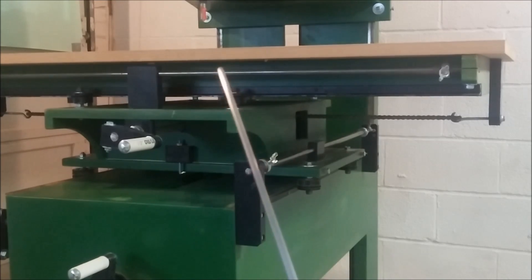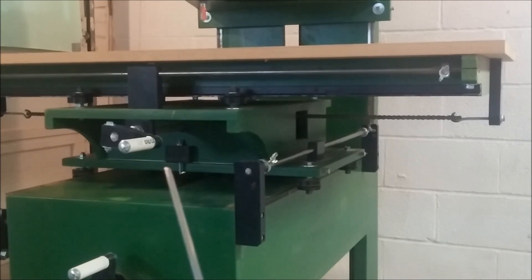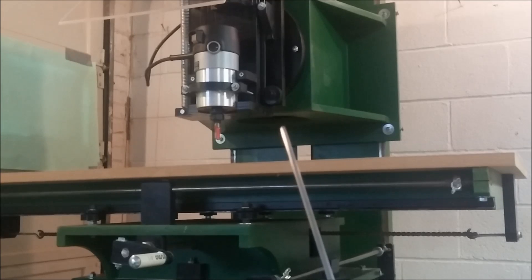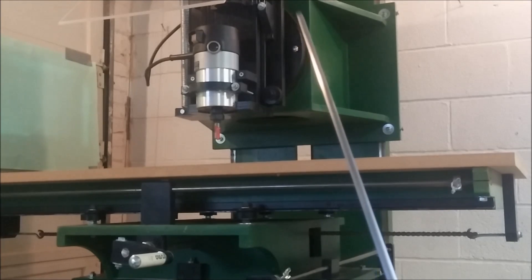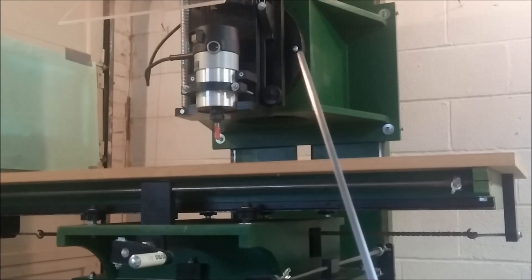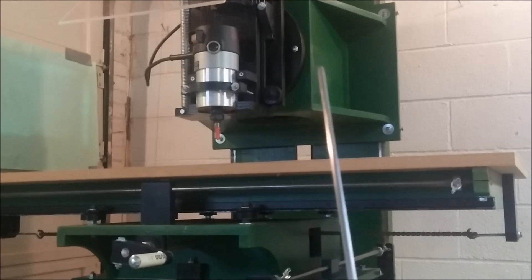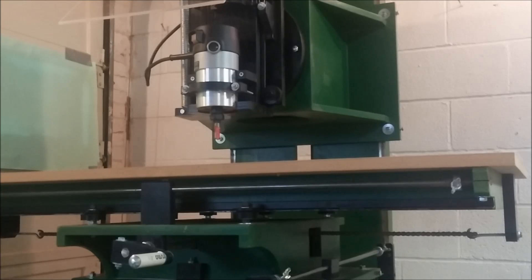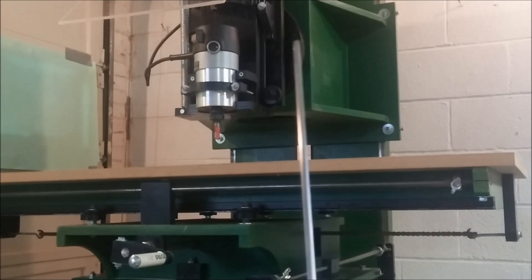In case I have to take this whole table unit off, it's just loosening this screw and the one in the back, and this whole section lifts off — because it's so wide, if I have to get it through a door or move it somewhere. There's also a big hole underneath here with two round discs that are convex on the inside. I routed them so only the outer one-inch perimeter is touching. When I clamp these two together with one big bolt — putting a wrench up in the hole to tighten it — it clamps down in almost any position; I don't need any locks. This little bolt here has a hole drilled all the way through, and it takes me back to 90 degrees after I've moved the table.